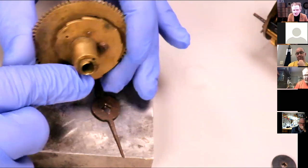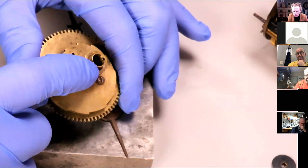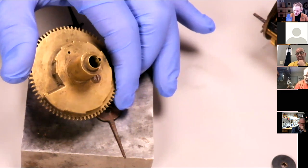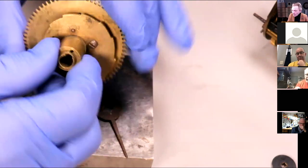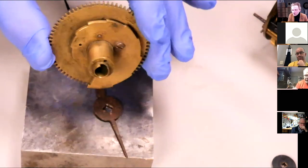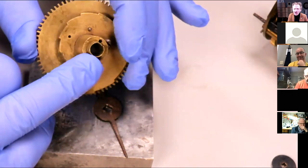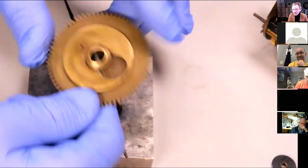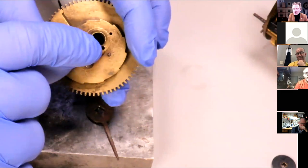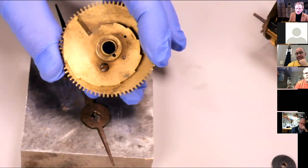So with this, which you will come across, the metal gets pushed down because the hand is a very good fit. The minute somebody center punches it or hammers it with a punch, kind of had it. So what you'd want to do is to tap that material back down again, but obviously you can't do it when it's unsupported. So you'd have to get a bit of brass and either file it or turn it. Again, this is tapered inside here. So it's a really good fit because you can see that edge there is only about 0.5 mil. So if you start hammering it to push the metal back, it's just going to collapse in on itself.